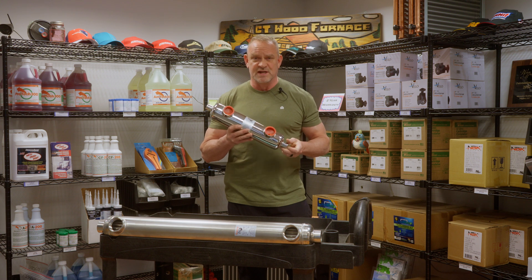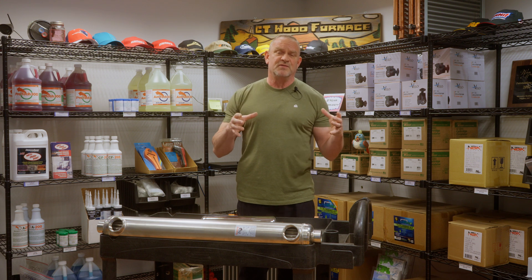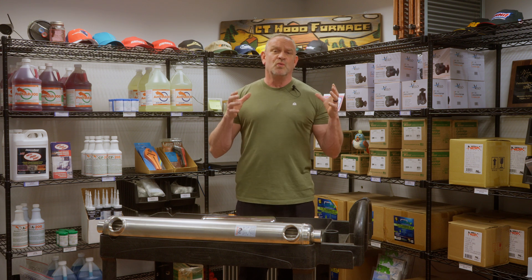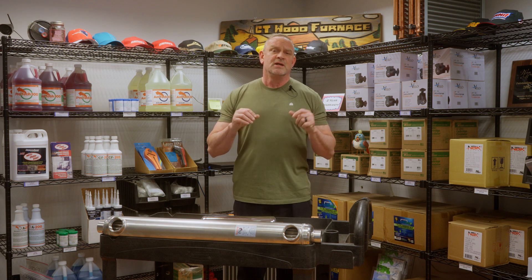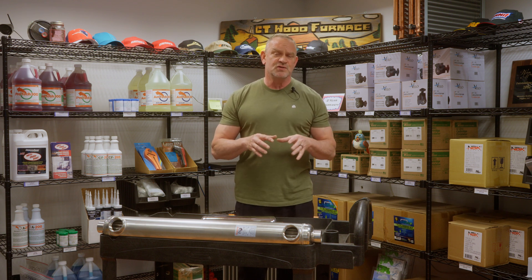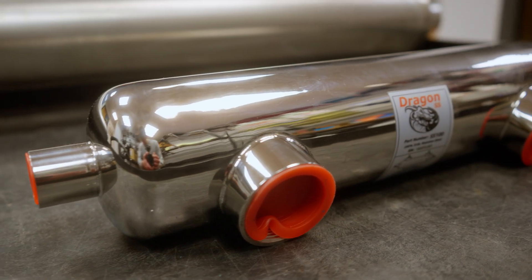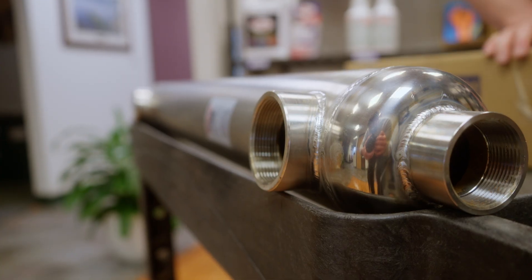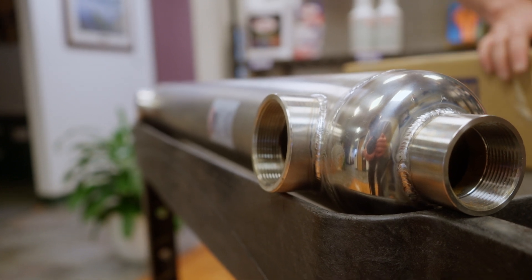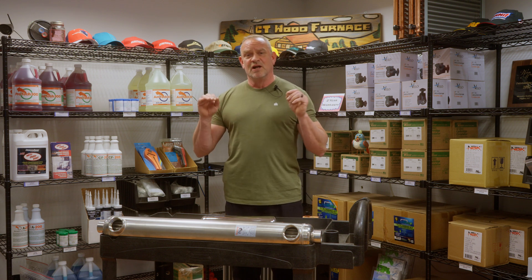The reason we decided to do this here at Alternative is we were tired of manufacturers changing their specifications on the heat exchangers — the thickness of the stainless steel, titanium, or Cupro Nickel keeps changing. In our application, the water is very hard on these heat exchangers. So we wanted high quality stainless steel, and every part of our heat exchangers had to be high quality. I increased the thicknesses of our stainless steel in our exchangers, and it does hurt heat exchange a little bit, but I'm willing to sacrifice that to get a longer life.